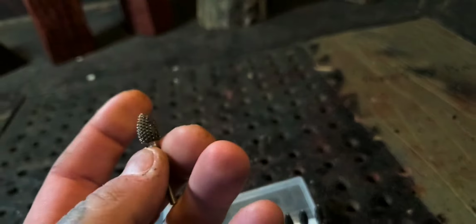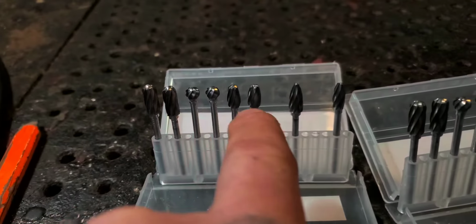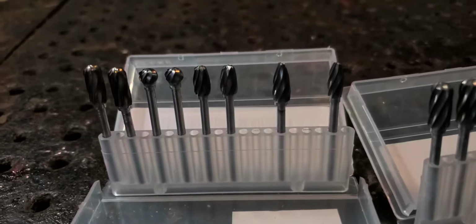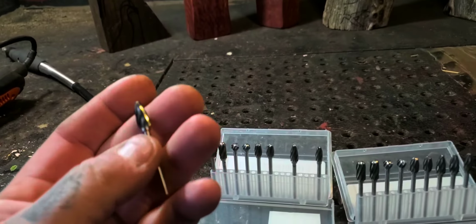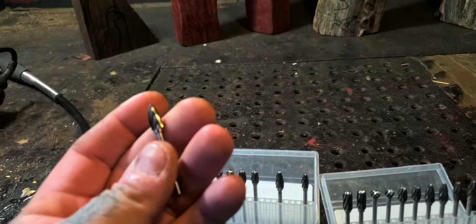Okay? So if this is a brand new kit, you guys can buy these kits. They're aluminum cutting burrs, 1/8. You can get them in quarters too, a 1/4 inch, okay? These are the best for hardwood for me because they last longest. They're made to cut aluminum, so you know they'll cut hardwood well too. But let's see how it goes. If this isn't doing it for me, I'm going to switch over to the Kutzall.